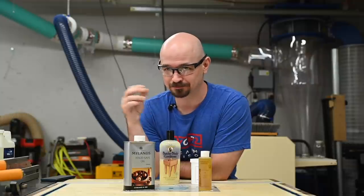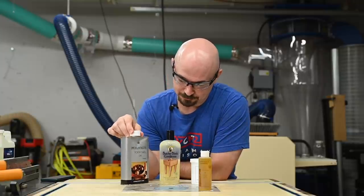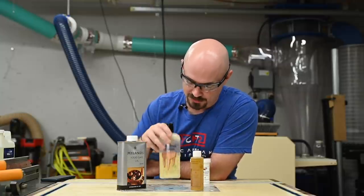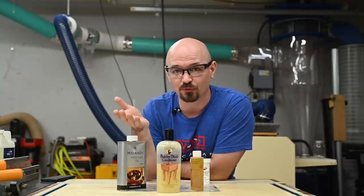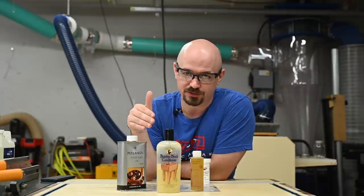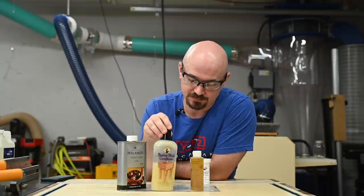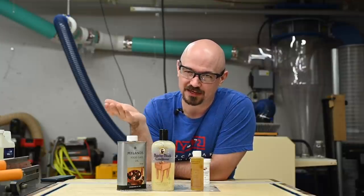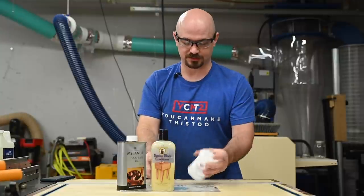Not much. So if you're tired of having oil marks on your counters, table, etc., all over the place, then maybe get away from using mineral oil and go to something that polymerizes, or a good way to do that is to use wax. So kind of like the Howards here, I have quite a few friends who do cutting boards, and what they do is make their own finish, commonly called board butter, which is just a combination of mineral oil and beeswax. You bring it to a simmer, add the beeswax so it melts, turns into one, then you have a solid, and because of the wax, that keeps your mineral oil from staying as oily. And beeswax by itself can be kind of tough to work with because it's so solid, so the mineral oil helps you buff in that beeswax, which is kind of the same idea as this.